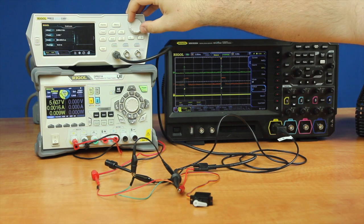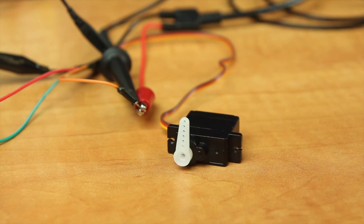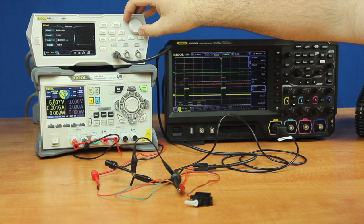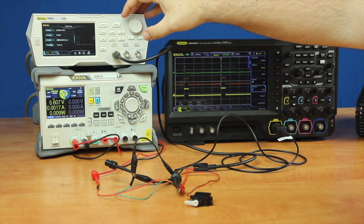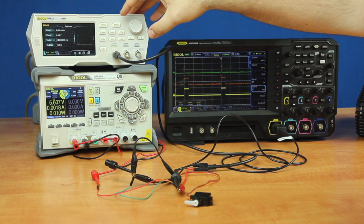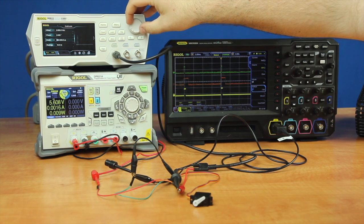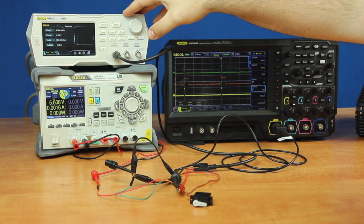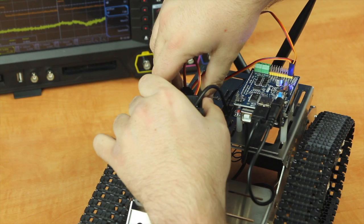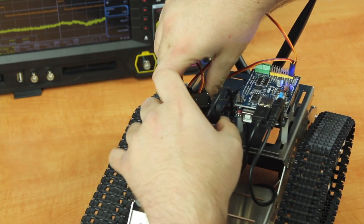As I increase and then decrease our width, we will see the stepper motor start to rotate. When we are all the way to the largest side of our signal, that is going to correspond to all the way up or all the way to the right on the arm in relation to the controls. And as I turn this down, we see the stepper motor move through, and at the smallest position this corresponds to all the way left and all the way down in our remote control sense. So now we know what orientation to place this into the camera arm.